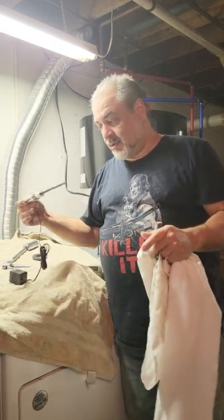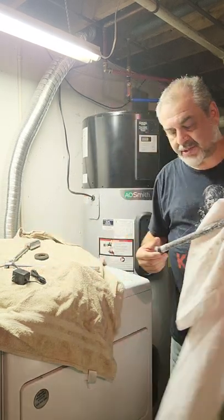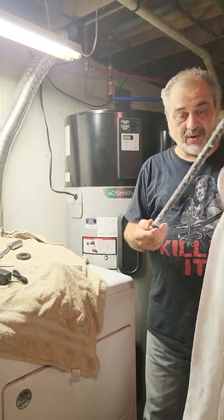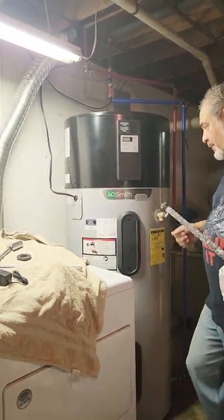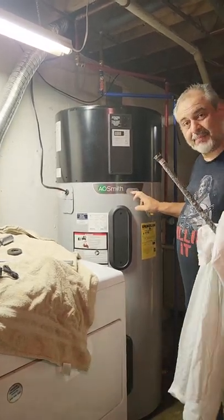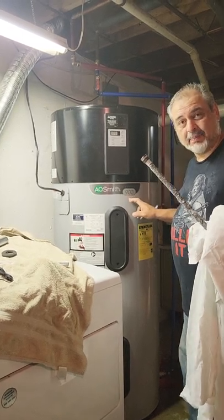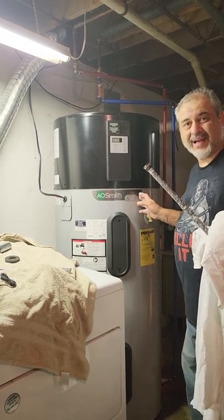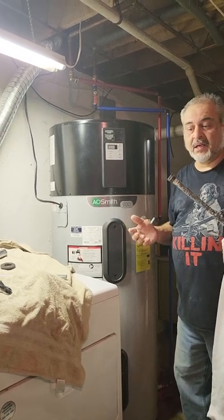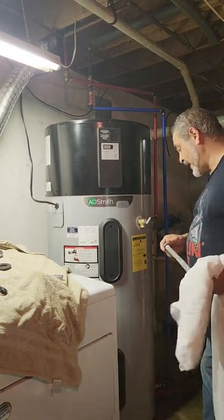So I'm going to put this in and we're going to see how it does — I've heard good things that they actually work. I'm not going to put the old anode back in because I don't want the sulfur smell coming from it. But getting back to my original point, if two-thirds of this anode is broken off inside my tank, it's going to keep doing its job and keep creating that bad smell in my water. Having this other anode may or may not work — just an FYI, if there's a piece of anode in there, I have absolutely no way of telling.